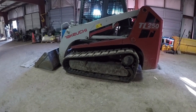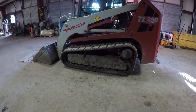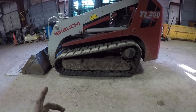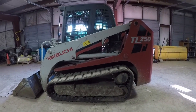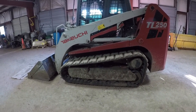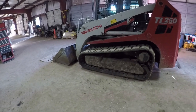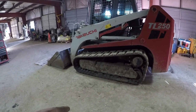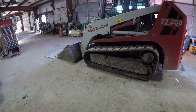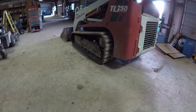I know it was a little choppy but I didn't really care to show draining the oil and changing that filter and all that. I kind of highlighted the parts that were different on the 500-hour. The 750-hour will be just the air filter and engine oil. I'll definitely video the 1,000-hour because it's everything you do with the 500-hour, except you take the radiator out and flush that, and you also take the suction strainer out of the bottom of the hydraulic tank, clean the tank out, clean the suction strainer, make sure there's no debris or metal shavings in there. Then you have to bleed the hydraulic system and run through a cycle raising and lowering the arms, curling and dumping the bucket — work any air out and get it going. Hope you guys have a good weekend and catch you later.